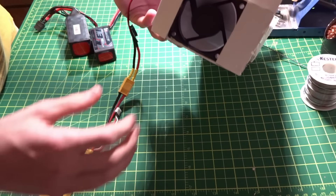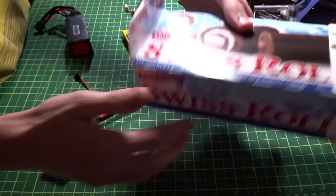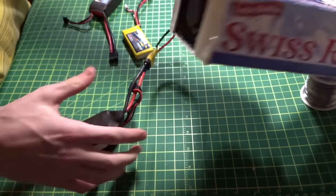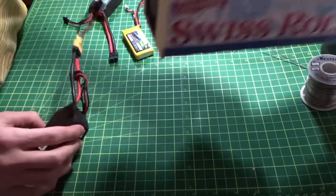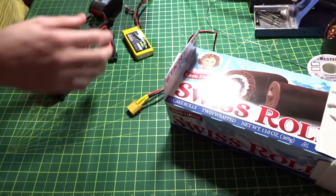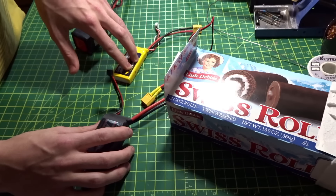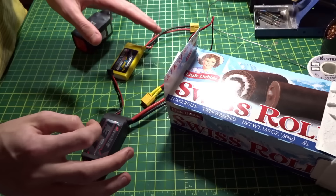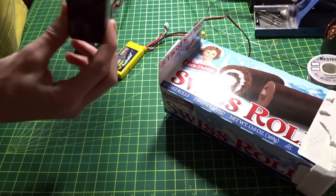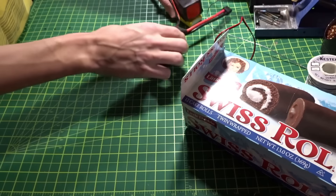As you can see here, if you want lower speeds for quieter operation — say if you're filming something — it won't be as effective at bringing in air. And you can also use 3S here, a little bit louder but a lot stronger. I've also run it on a 4S even though it's only rated for 12 volts. It really picks up the fan then, and I left it on for about 10 minutes on 4S and it only got slightly warm on the motor, so it should be okay. Two and three S are definitely fine. I also plugged my battery meter into the balance lead while I left it on for about an hour and monitored the voltage drop — it looks like it might be drawing about 20 milliamps, so it's really low current draw. On something like a 3S 1300, that's gonna last I don't know, two days of full full-on usage.